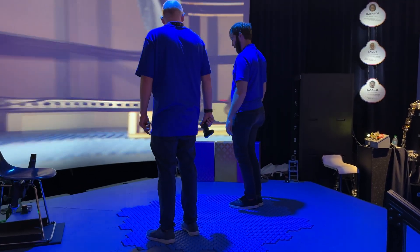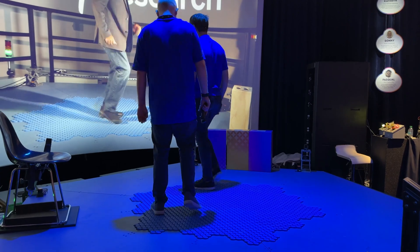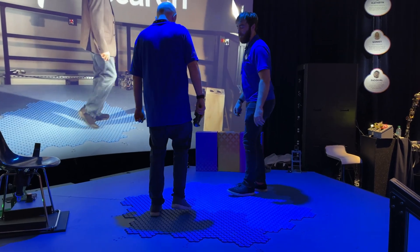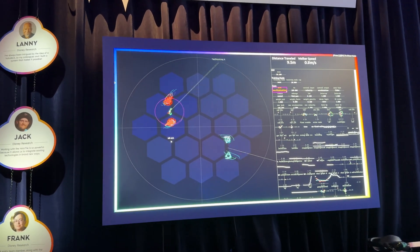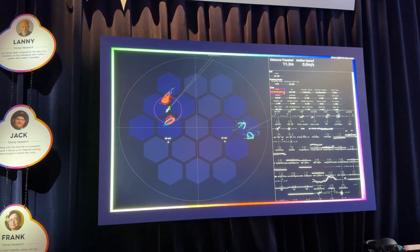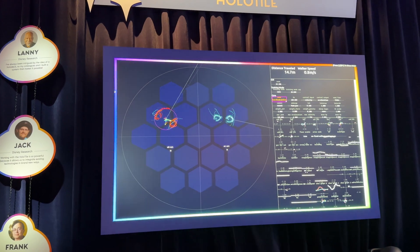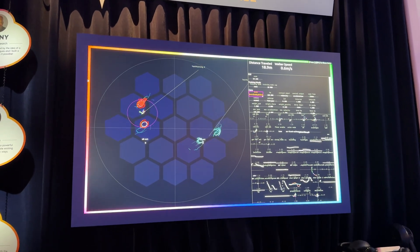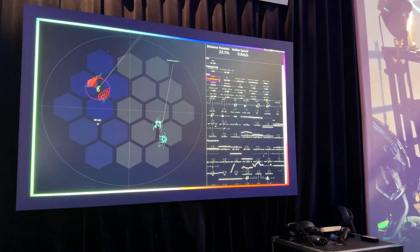Now we're going to see a demo where two of them are walking on there at the same time. In the corners, there are these little LiDAR sensors that are picking up their actual feet and when they move their feet. So it's tracking them and compensating for them so that they will not change location. As they walk around, the computer will automatically spin the disks. Over here on the left, you can see the hexagon sections of the entire floor. It figures out which hexagon section it needs to manipulate, and you can see their feet according to the LiDAR — where they are and what they're doing. There's a vector on there that shows what direction it needs to roll the wheels and how fast. It's really, really responsive and fast.